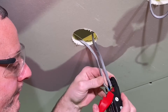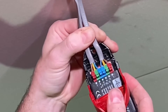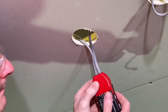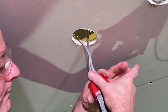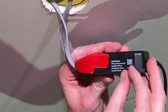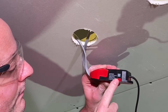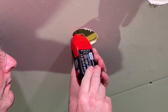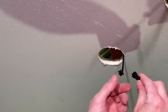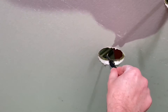Strip back your cable and simply push your conductors into the appropriate color-coded connections. Put the cord grip on. On some of the drivers you have the ability to change the color temperature, but on all of them the light fitting itself is disconnected, meaning we can push this back into the ceiling when finished and allow the decorating team to come along and paint the ceiling before we connect in the actual light fitting itself.